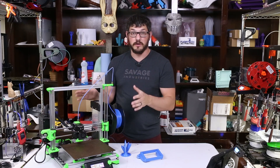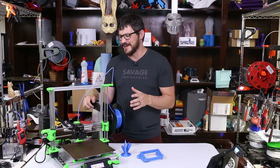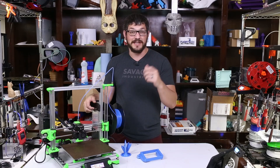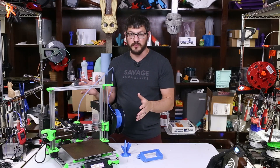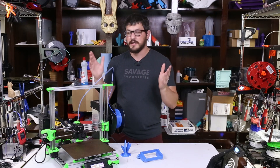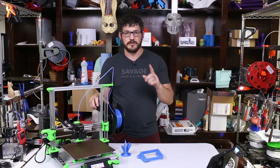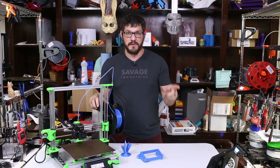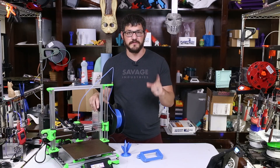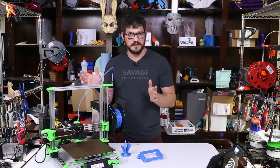I got this built and used Marlin 2.0 — I built my own firmware for this. That took a few live streams to get going. I am much better at firmware nowadays, eight months later, but you have to start somewhere. I did borrow a lot of ideas from Chris Workaki's SKR Bear firmware, because I like the way he has Marlin configured. So I borrowed a couple of things from him to get Marlin built for this machine, as it is very similar — the build size is close, just a little higher on the Z.